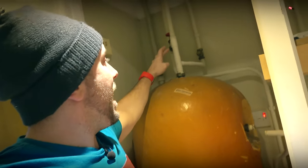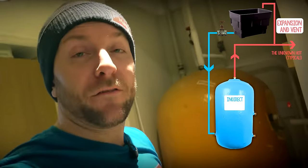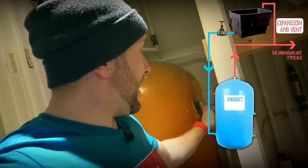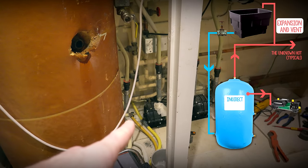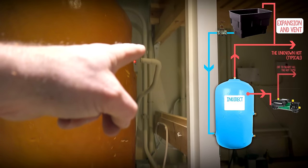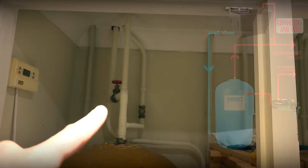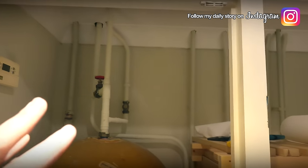We've got a 28 mil hot out, then hot off to the taps. There must be a hot here that's not pumped, because just out of shot there's a Salamander pump pumping all of the hot water and all of the cold water. The feed for the pump comes out of this side here on this Surrey flange — that's our feed pipe that comes out of the Surrey flange, goes into our pump, gets pumped out, and comes up this pipe here across to there. There seems to be a weird balancing valve that comes back here — I can only think that's there if the pump fails, so you can still supply water off to the system.